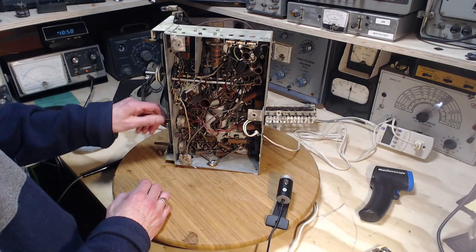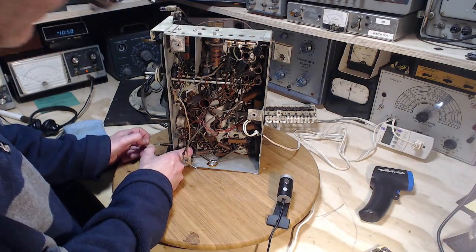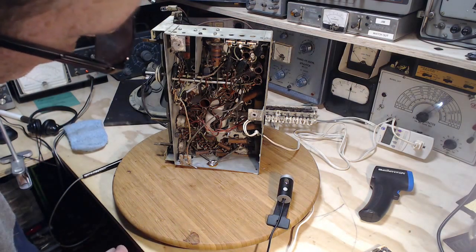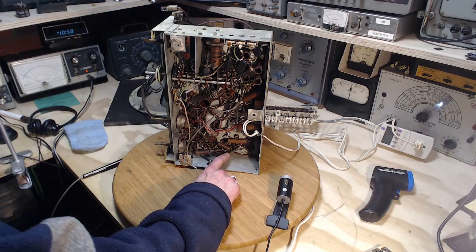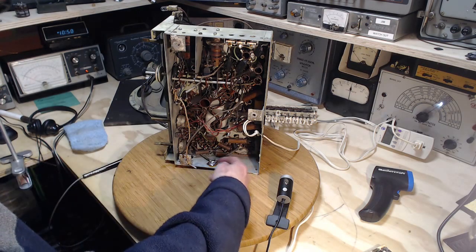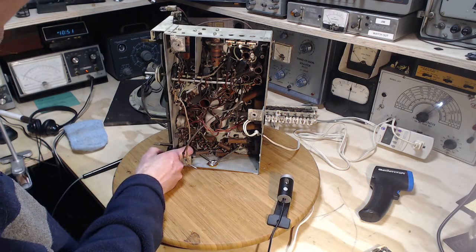I went out and checked the cabinet. So the tone control has the switch. This is the volume one down here though. So all we got to do is listen to this wire right here, which incidentally is connected to the cable that goes to the push buttons, and I believe it's the phono connection. So that all makes sense. You can also see a shielded wire here. That's probably carrying a very weak audio signal from the radio. Looks like it's heading out on the cable up to the switch. Then the switch is either selecting the radio output to continue back in, or a signal coming from the phono. It all makes sense. So all I got to do is listen here.